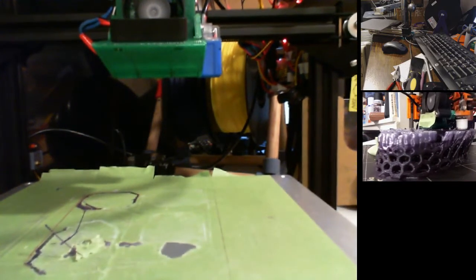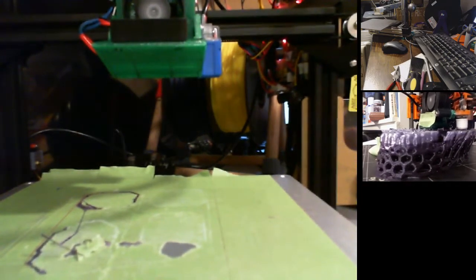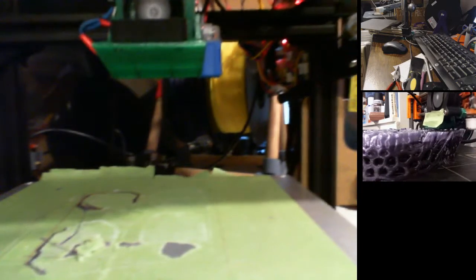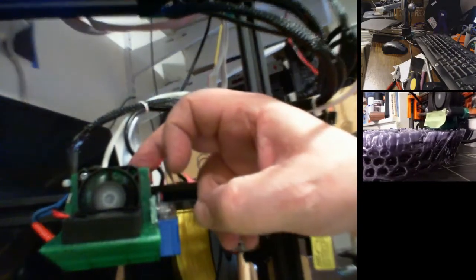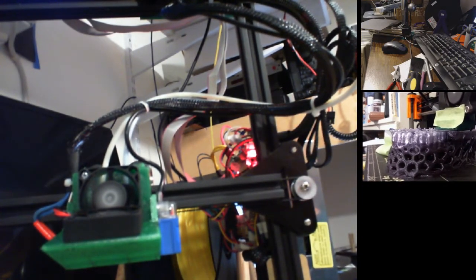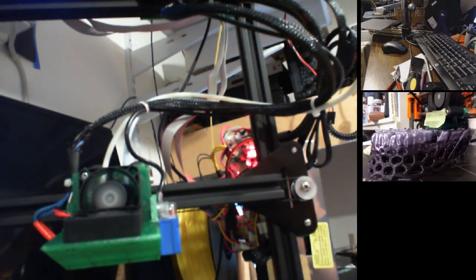And what I'm going to do over here is, you have virtual extruders in this firmware. So you've got tool 0, which would be our cyan on the right hand side, and tool 1 is on the left hand side. You can swap those around however you want, but you also have tool 3, 4, 5, 6, 7, 8, 9, 10, and 11.